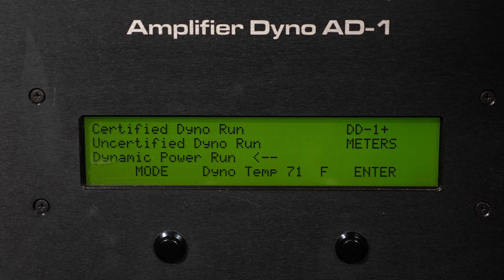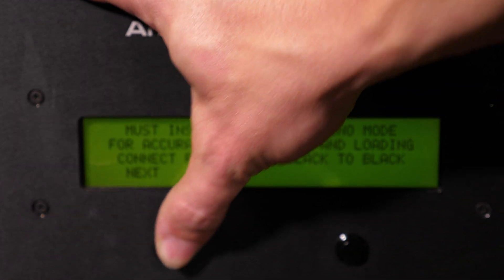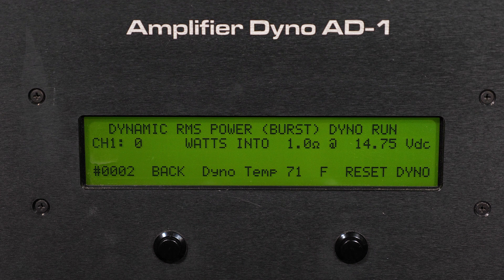Last but not least, we're going to jump into our final dynamic power run on the SKV2 1500 at a 1-ohm load. This test measures peak power or burst power output of the amplifier — a lot of you tend to like this one more because this is that max power rating you're looking for. Go ahead and watch your screen — it's going to send a burst signal. The test is finished, and we have 2,140 watts at that 1-ohm load at just slightly less than rated voltage: 14.23 volts. They're rated at 14.4, so quite a bit more power output than what they're conservatively rated at. Overall, just a great Class D monoblock amplifier. Thanks for watching, and stay tuned for more.